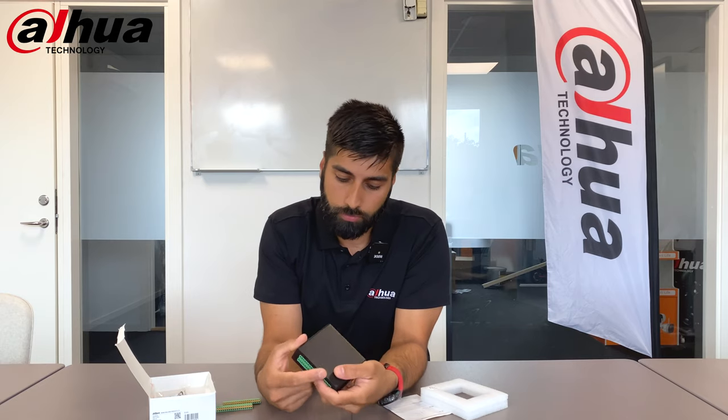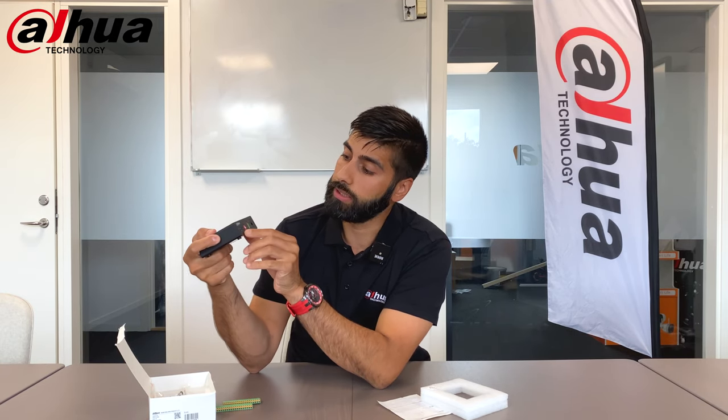At the front of the alarm box, it has a power indicator and an ACT indicator which blinks every second to confirm communication between the NVR and the alarm box. It can also be used with an XVR. We have DIP switches where you set a specific address for each alarm box, since you can use multiple boxes with one NVR. There's also the A and B RS485 connection to connect directly to the NVR, and then daisy-chain from one alarm box to the next.